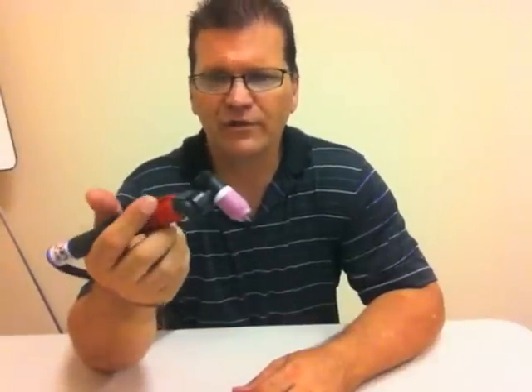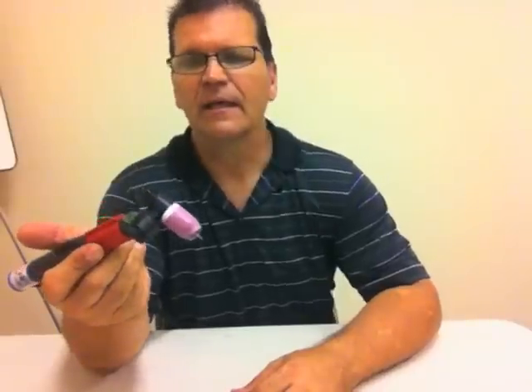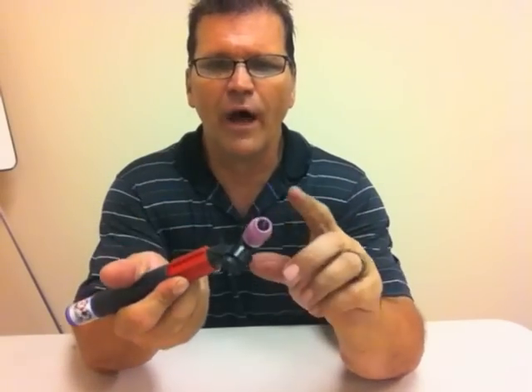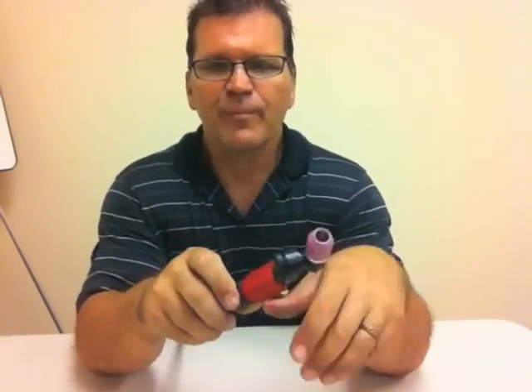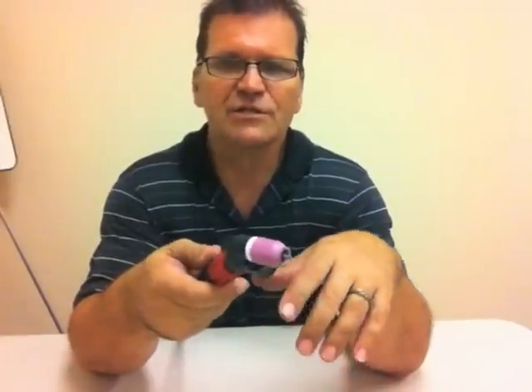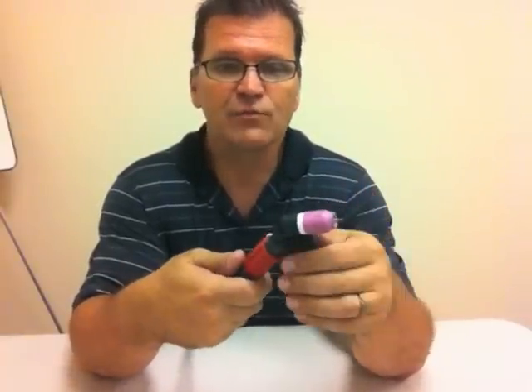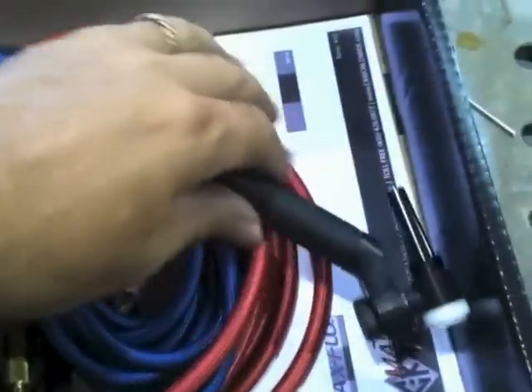In today's video we're going to show a very innovative welding torch made by CK Worldwide. It's called a Flex Lock because it's like a flex head — you can get practically any angle you ever want, but once you get that angle you can lock it so it's rigid. For all you people that like to walk the cup, it's hard to walk the cup with a flimsy flex neck that wobbles around, but this one lets you lock the angle in place and get a really solid prop on the metal.